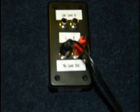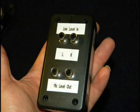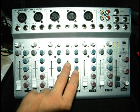Use the actual Y-cable — this particular one you can buy at Walmart for about four bucks. The RCA plugs go into the output side of the box, and the plug goes right into the camera's mic-in. What this box does is take a line-level signal in — for example, from a mixer. To give you an example of mixers you can use: a big board like this Behringer MX9000 I use for recording, or little mixers if you're doing small interviews or improv shoots. You can use lavalier mics into the mixer, and then the mixer's line out into the box and into the camera. This really opens up a lot of possibilities for the consumer or even the novice video camera shooter.